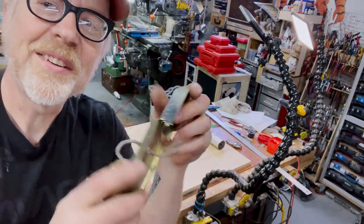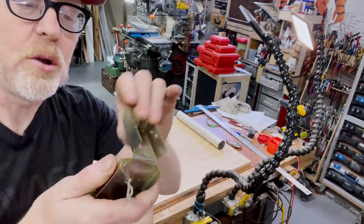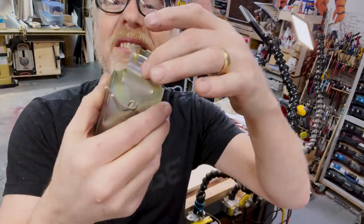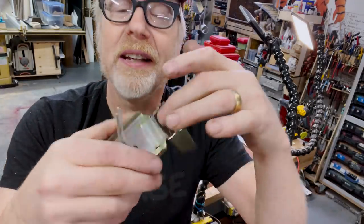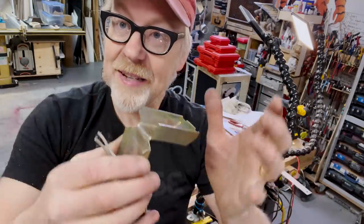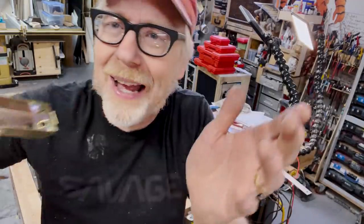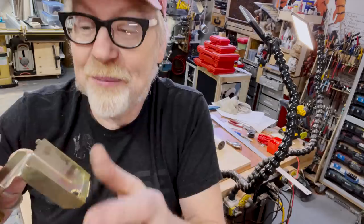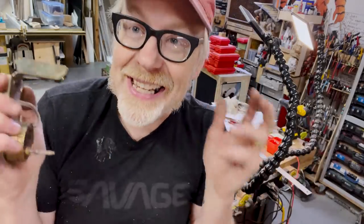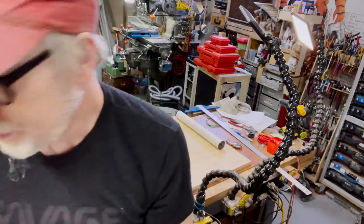When you're bending something back and forth in order to break it, it's called work hardening. And what you're actually doing is, imagine the small atoms in the steel. They're all next to each other and you're bending this. When you're doing that, you're actually smooshing those atoms past each other. And that friction of the atoms and molecules moving past each other because you're bending causes them to heat up. And when they heat up, they actually change the structural properties of the steel, weakening it and causing it to break.